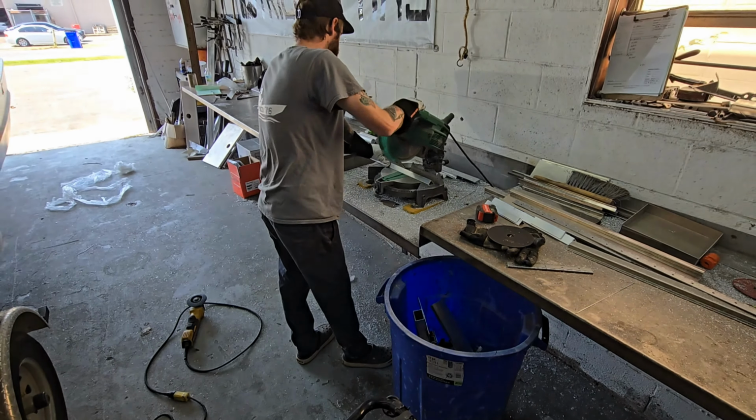One thing I did that I haven't done before was on this interior seam, I bent an angle. And that makes it a whole lot easier to weld, because if you're trying to weld up in that corner, that seam is tough to get to. But by bending it back, that seam's a whole lot easier to get to. We just welded that one straight pass up there.